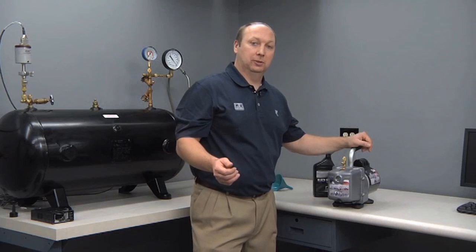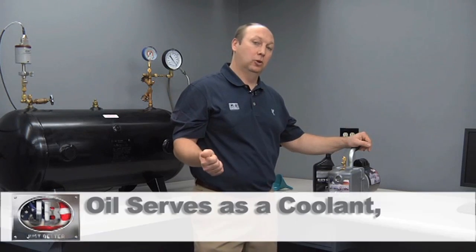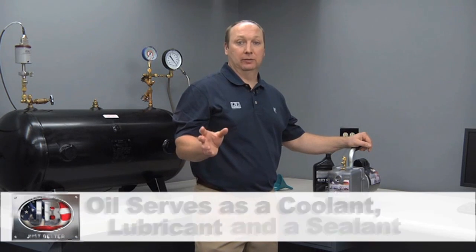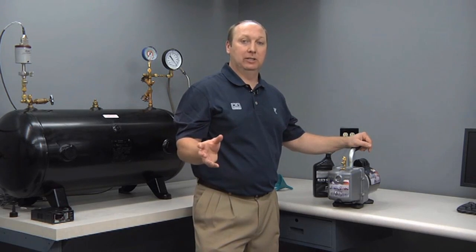The vacuum pump oil serves 3 functions in a vacuum pump. It's a coolant, a lubricant, and a sealant. The oil really is the lifeblood of your vacuum pump, so we recommend changing after every use.